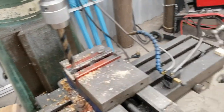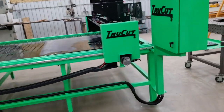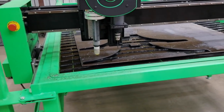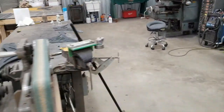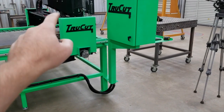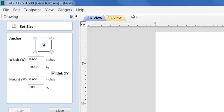Especially just taking a little bit out. What we can do, if you haven't moved your machine after cutting the job, is reposition the plates. We just cut two plates out and I'm back at the home position, so I'm going to take all the plates with holes too small and one by one put them back in that first position and let the machine recut the holes. I'll show you in CAM how we make the adjustments.